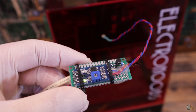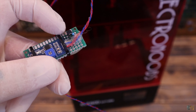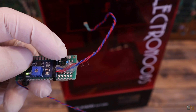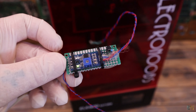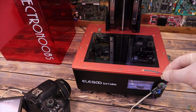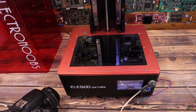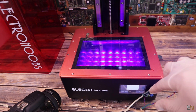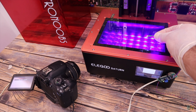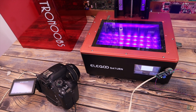The camera shutter activates with a connection to ground. We connect this output — which will be high — to a transistor first. To the collector we connect the input pin of the camera, and to the emitter we connect ground. Each time the output is high, the transistor activates and makes a connection to ground, and that's how we take the picture. Here I have my printer with the UV light on. Each time I put this LDR in front of the light it takes a picture. Actually it takes the picture when you remove it from the light, because that's when it makes the connection to ground.